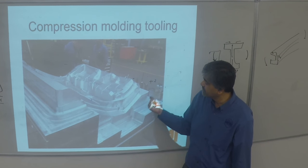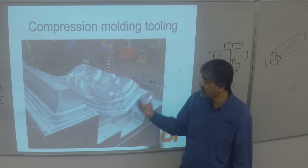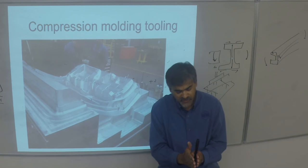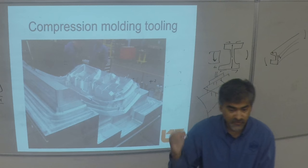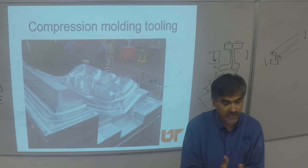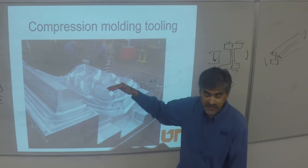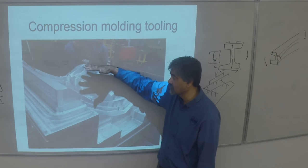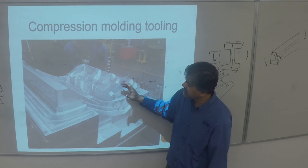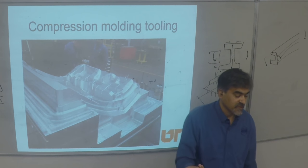The part has a challenge of having the same compaction on the horizontal surface as on the vertical surface. You always get differential thinning — differential thickness in terms of how much material movement you get. For injection molding it's not a problem because you have a fixed cavity. In compression it's a dynamic cavity — the cavity is first tall, then starts closing until it fully closes out. The ability to keep local part thicknesses the same is the challenge.